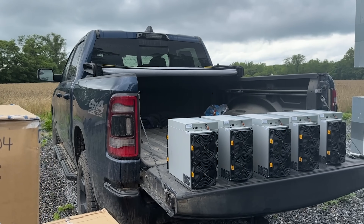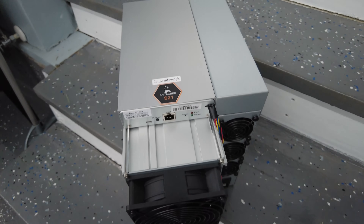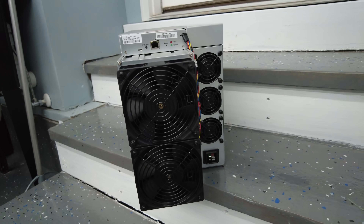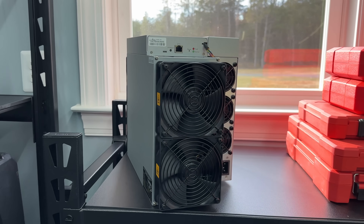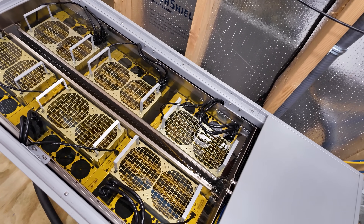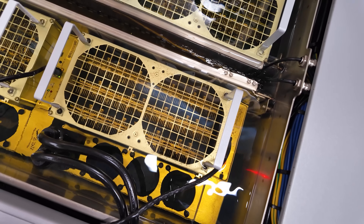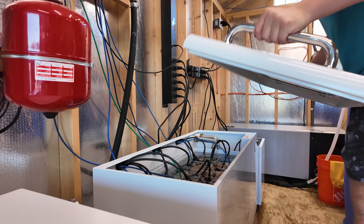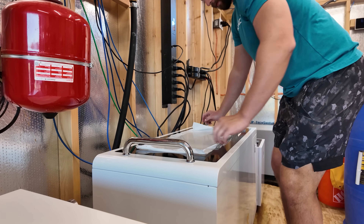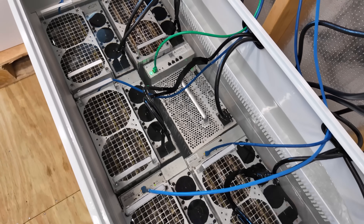The point being, I'm spending a lot of electricity to not earn all that much Bitcoin with this older hardware. And this newer generation of Bitcoin miners like the S21s — they are killing themselves in different immersion infrastructure deployments. For example, they will nuke themselves in the Fog Hashing C6. The S19 XP — heavy emphasis on the 19, not the 21 — in the Fog Hashing B6D, I had a couple miners kill themselves in there. I also had S19J 104s that fried their hash boards in there, simply due to inadequate cooling design, which I think is a big reason why they moved to the C6. I never had any of those issues with the S19 generation miners and the newer Fog Hashing equipment. But the newer Fog Hashing equipment was not the right solution for converting air-cooled to liquid-cooled S21 series Bitcoin miners.